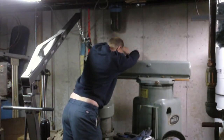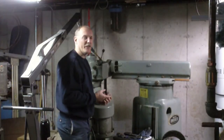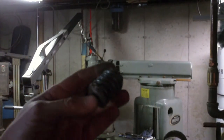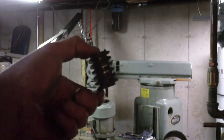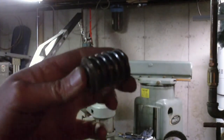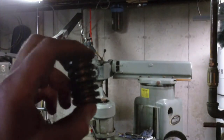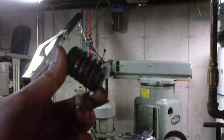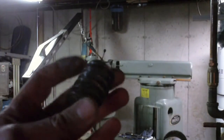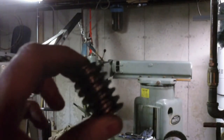Now I'm going to clean up that little worm gear — it's got all the swarf and grease and everything on it, and reinstall it. There is some stuff on this gear, and on other parts of the machine too, that looks like it originally started out as some sort of grease and has become — for lack of a better term — tar. The LA Awesome was not able to tackle this. I'm going to try the 3M engine degreaser, which is a lot more powerful, and see how it fares.